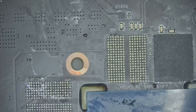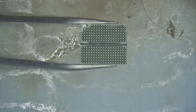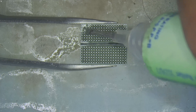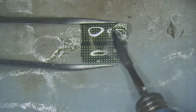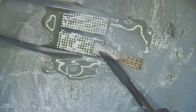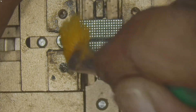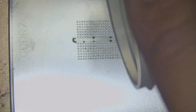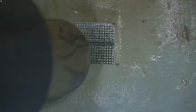With the PCB pads repaired, I moved on to the memory modules themselves. Thankfully, all the pads on the memory chips looked intact, so I could reuse the original modules after re-balling. For each memory module, I added flux to the chip, removed the excess unleaded solder, tinned it with leaded solder to reduce the melting point, and then wicked the pads flat with the solder wick. Once the chip was clean, I placed it on a stencil holder, applied a thin even layer of flux, positioned the stencil, and dropped 0.45 mm solder balls over it. Then I reflowed the balls until all flowed and attached properly.